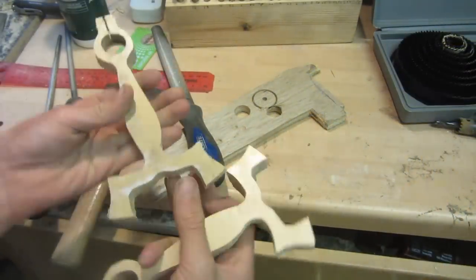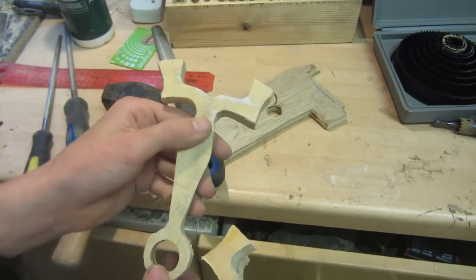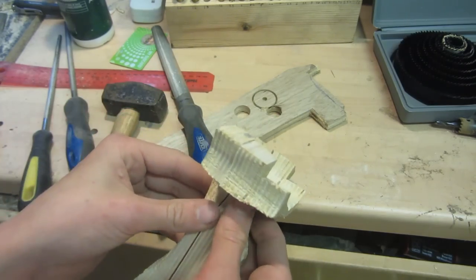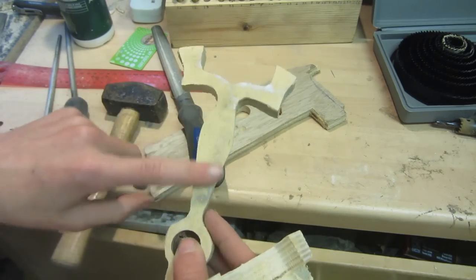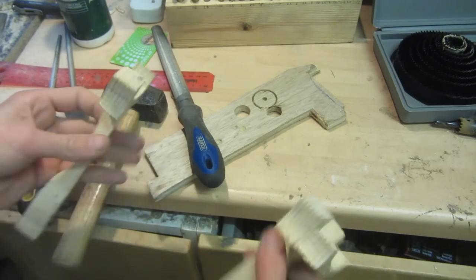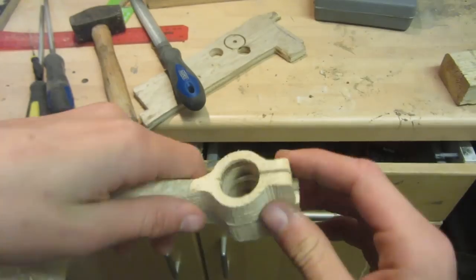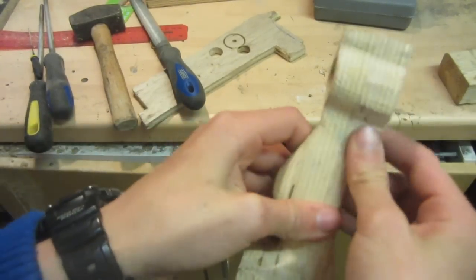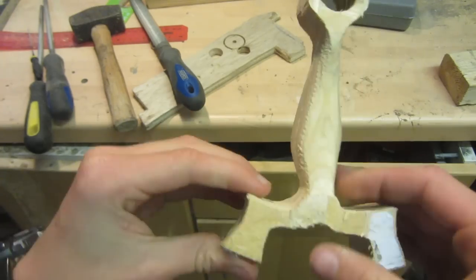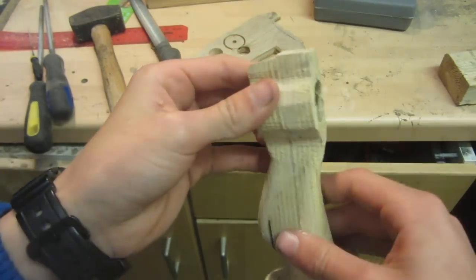As I was cutting the slot the two layers delaminated. It's because this plywood had a polyurethane coating on one side from its furniture use, and when I glued it together I forgot to remove that coating. So I went to the belt sander, removed the coating and excess glue, then glued them back together so they line up exactly — now it's wood-to-wood contact and it's on really firmly.